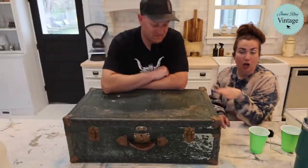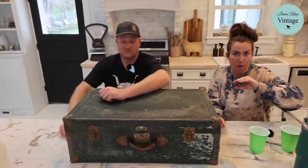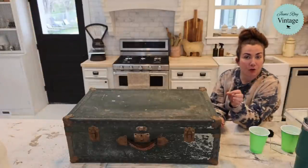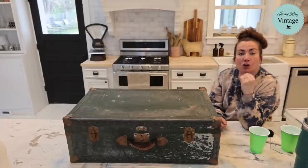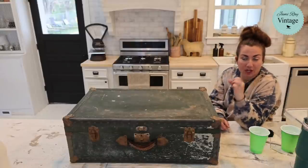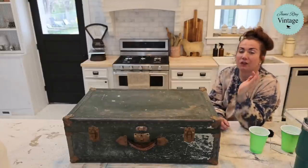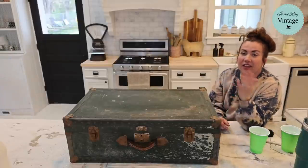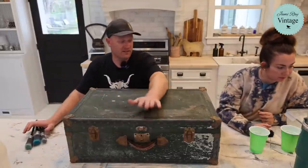If your wood is raw and you want it to chip, do whatever your base coat is going to be — stain, paint, whatever — then seal it really well with a couple coats of top coat. You can also spray lacquer outside, and then before it's all the way dry, when it's still a little tacky, paint your milk paint on and it will chip. If you still can't get it to chip, get it wet and use a heat gun.